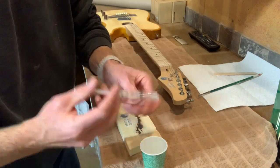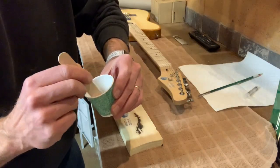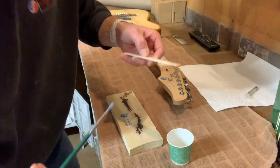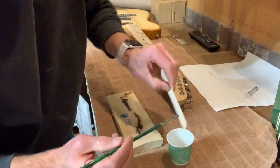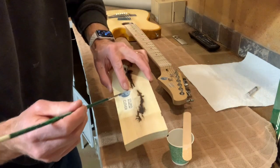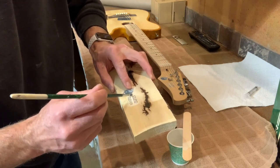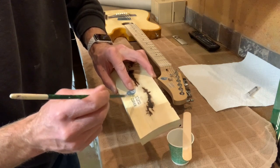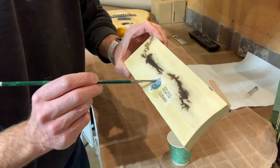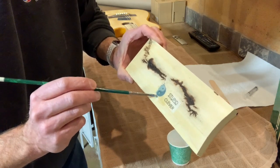I'm going to add my three-to-one ratio — one to three of my hardener into my epoxy. That's mixed up pretty good. I'm going to try and scrape it off with one of my daughter's paintbrushes and just apply this and see how it looks. The idea is that the epoxy is going to soak right through the rice paper, and it is — I'm seeing the wood grain pop through pretty easily. Once you mix the epoxy and the hardener and the resin, you've got a limited amount of work time, but for this kind of application you should have all the time in the world. And I think that's going to look pretty cool.